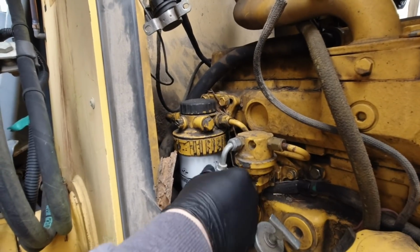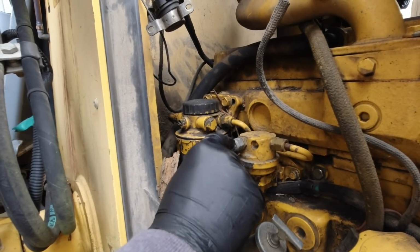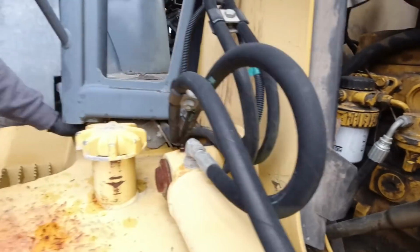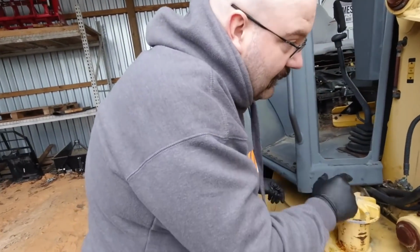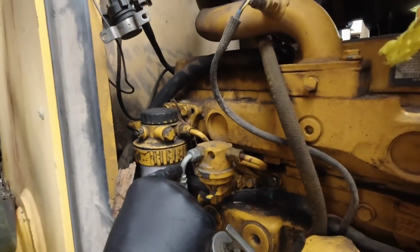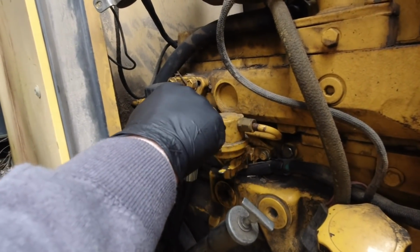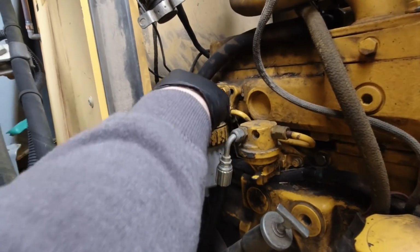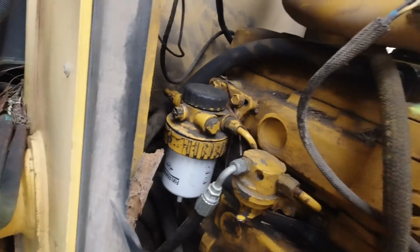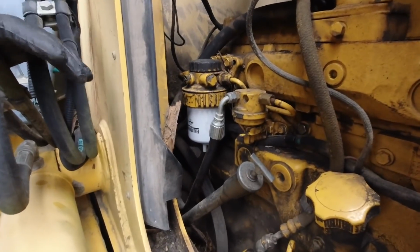That's not good. That's definitely going to suck some air too. Yeah, so I would say we definitely need to do something with that fitting for sure. But really the only components are the tank line to here, this fuel pump. From here, this is the inlet to the fuel pump. This is the outlet, it comes around to here, the fuel filter, then the outlet here, around the back of the head, up to the high pressure fuel pump. Right. So really, that's our only system in this.